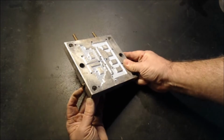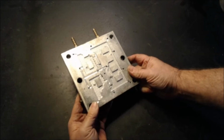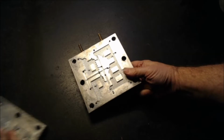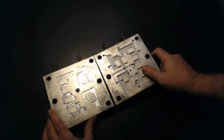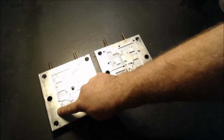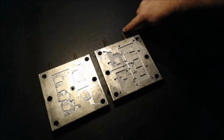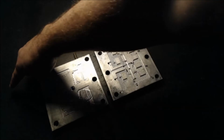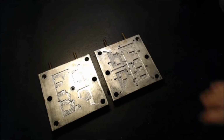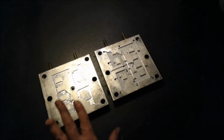The brass is for the cooling, and the detail of the part is CNC'd in here. One of the things that you can see, once the hoses are hooked up, the cooling water will come in, cross over, go back out, come in, cross over, and go back out. So it'll come from the cooling tank, pass through here, and then go back out. Very simple cooling system, and aluminum displaces heat pretty well. So that works